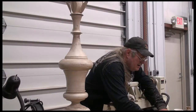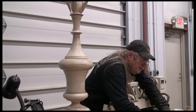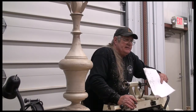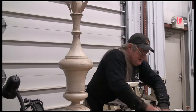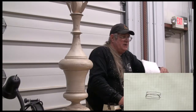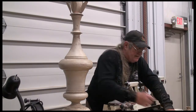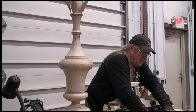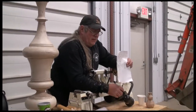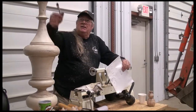This is a lamination of four pieces this way, so what I had to do there was the two inside laminations, because I had to remove the screws on this piece. I couldn't cut around. I just drywall screwed from the edges in to clamp, like so. And when those two were set up, I took the screws out, and then I could face screw two more laminations onto that, and then remove those screws, and I had the blank to do the top here.